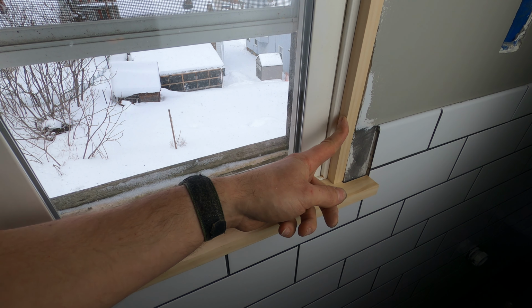It's like money. What it does is it saves you money on your heating and cooling costs. Now, I said earlier that there was 18 inches of the pink stuff up there. Well, I was a little bit off, as you could see by the video. It was closer to 12 to 14 inches, something like that, which is what gave me that R40. Now, beneath that was the cellulose stuff, and there's 6 inches of stud or floor joist in there. And it's like 3.2 to 3.8 per every 2 inches. So I'm rounding that average to about a 10. So 10 plus 40 is 50. And that's really pretty good.